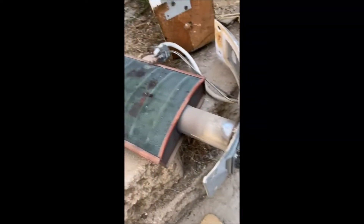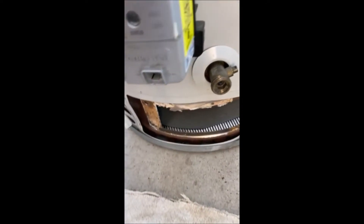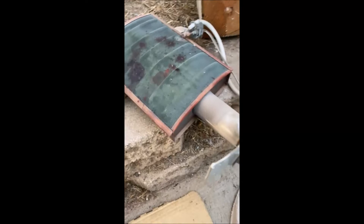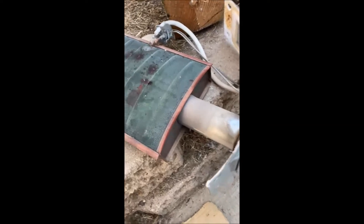It's pretty scary, but fortunately I've got some backup burner assemblies, so I'm going to do a direct swap on this water heater. This thing is probably about a third full of water — you can't really run them dry or you can crack the bottom of the combustion chamber, which is the bottom of the vessel holding all the water. So I need to put some water in to keep it cool because I have to run it for 15 to 30 minutes.